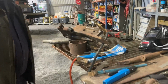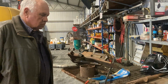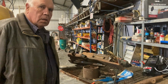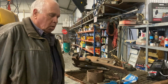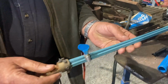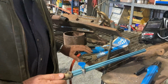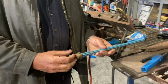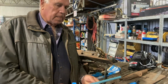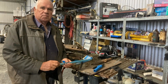So you sort of worked out a formula, or a rough formula for the amps, knowing that most people probably only have access to maybe a 200, 250 amp welder. What was the formula that you worked out? Well, roughly, I've got a bunch of fairly new GP rods. This is the first time I've tried with new rods. All the other times experimentation I've done is with old rusty rods. So I'm going to try this and see what happens. But the 3.2s, I think we work on with one rod, it's about 130 amps. And then I find approximately for 3.2s, you add 50 amps per rod.